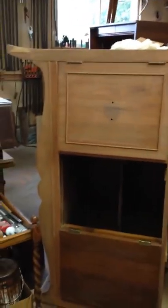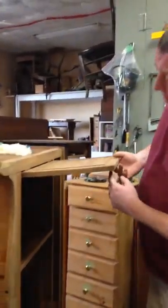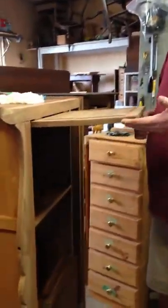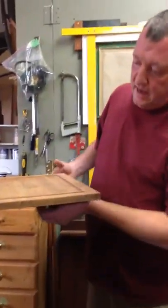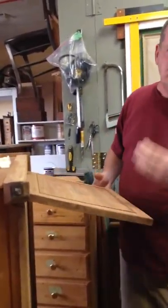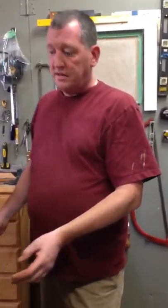Then you can come down tomorrow and have a look at it in its finishing stages. And you can have a look at this beautiful walnut sideboard I've got all stripped. The issue on these doors is they're all bowed — I'm just going to steam the doors and add plates on the back to pull the bow. It's the most economical way to go and it's not going to interfere with anything inside the cabinet.